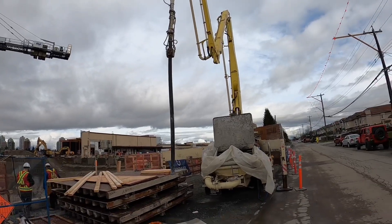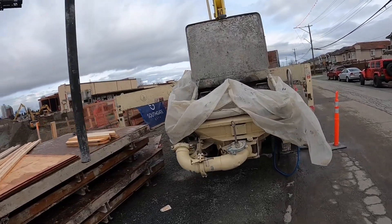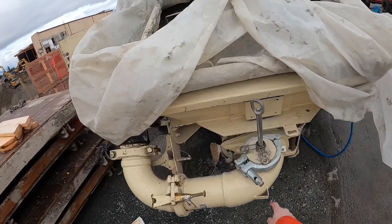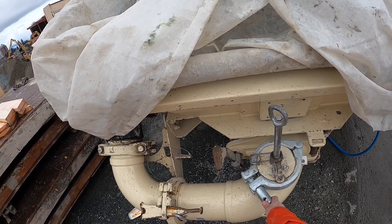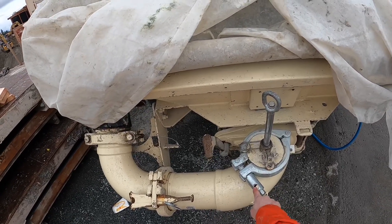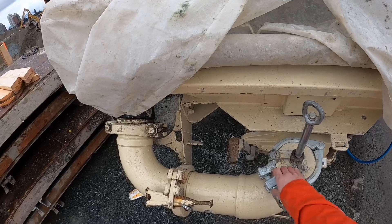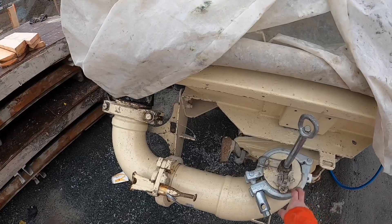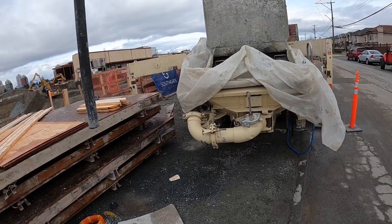While we wait, I know a lot of guys are going to ask why I don't put my primer into the primer port. The reason I do not is that the threaded stud for the movable cap is a coarse thread, and it's surprising how quickly those threads will wear out and strip. You get to the job site, go to tighten your cap down, and the threads are gone — now you're trying to improvise a solution to hold that cap tight for the duration of the pour.